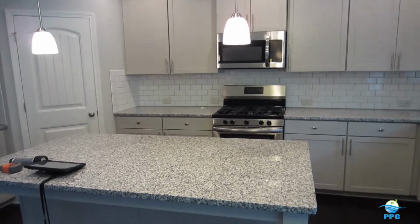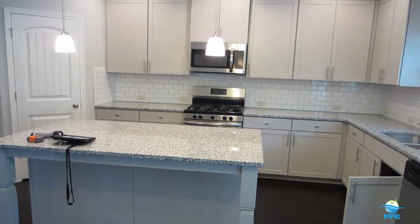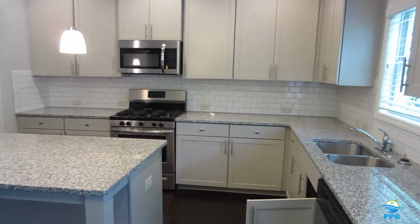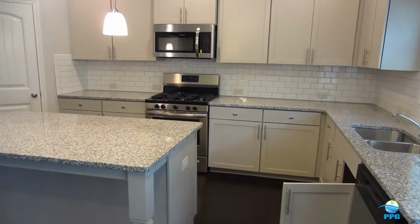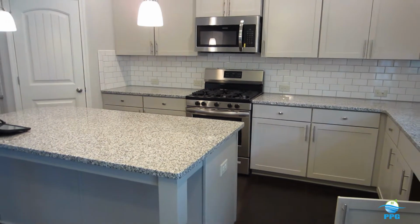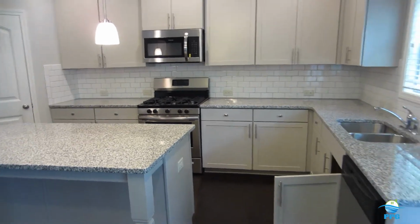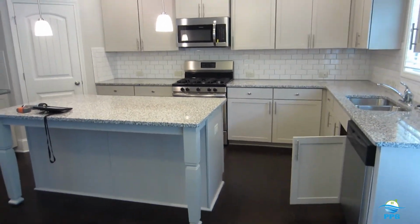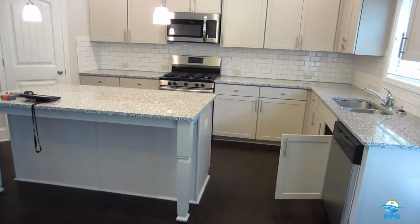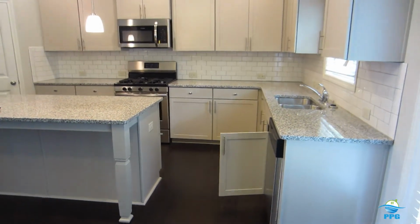But I would, at a minimum, if you have little babies, little kids with their own rooms, or they have access to different rooms, playroom, sunroom, family room, I would definitely look into retrofitting those into the interior of the house. And like I said, I'll leave a link for you to read more about tamper-resistant and G.F.C.I, ground fault circuit interrupters. If you're living in an older home, I would look into retrofitting these in the kitchen area, bathroom, and in your garage, and any outlets, receptacles you might have on the exterior.